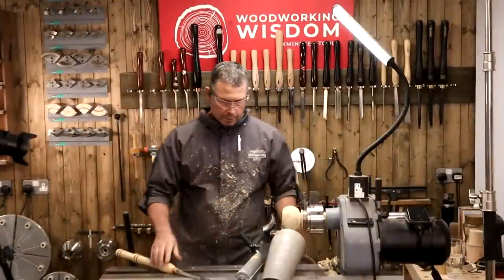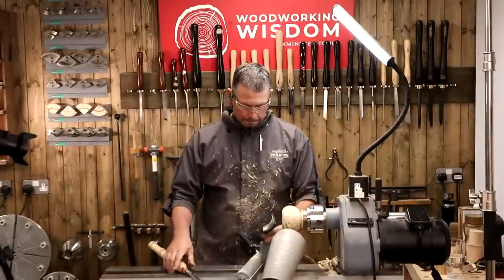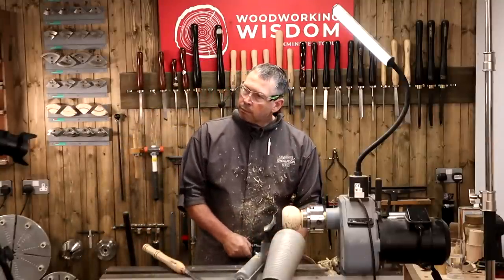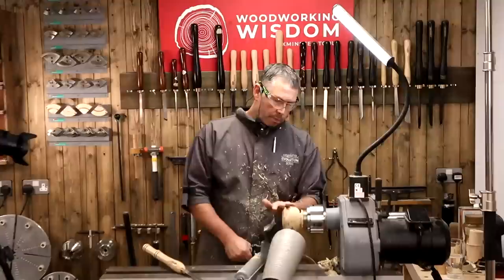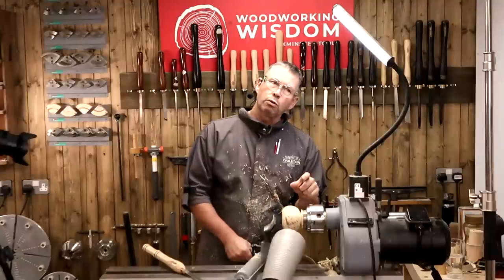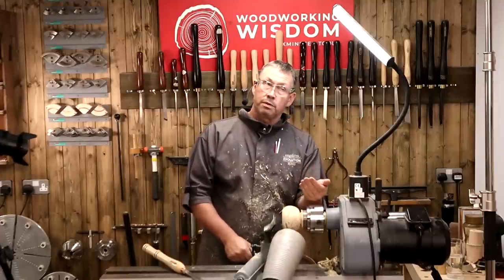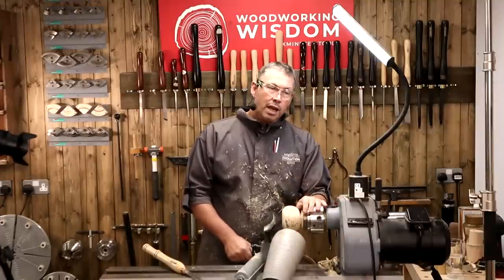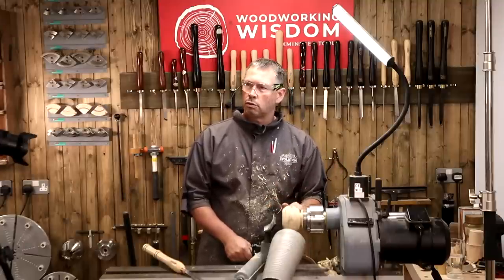Yes, Ben. So Frederick's asking, is it okay to use the O'Donnell jaws for holding? Yeah. I did look at those a minute ago, but this is a little bit soft, and the O'Donnell jaw dovetail was a little bit small, and I thought I don't want to throw it out of the chuck. So that's why I went for the grippers, because this is quite soft. If it's a regular timber, no spalting in it, then absolutely. I use the O'Donnells a lot for doing that.